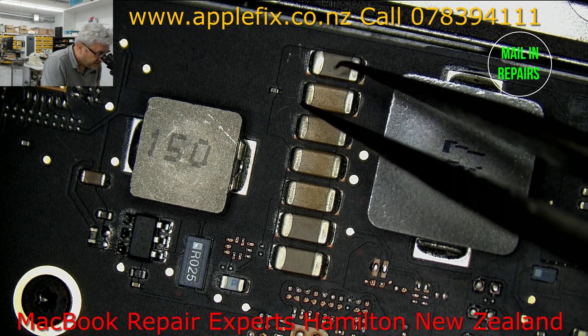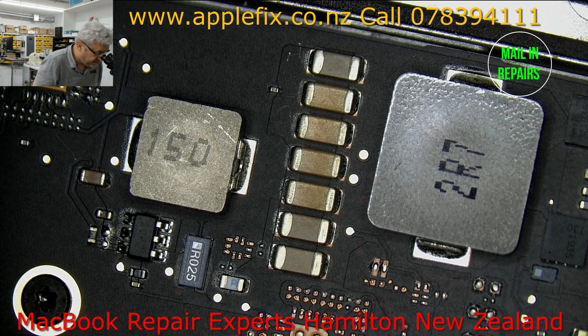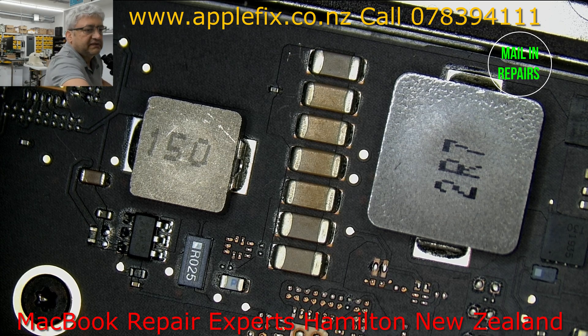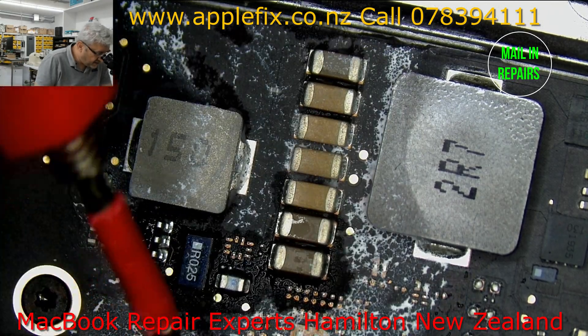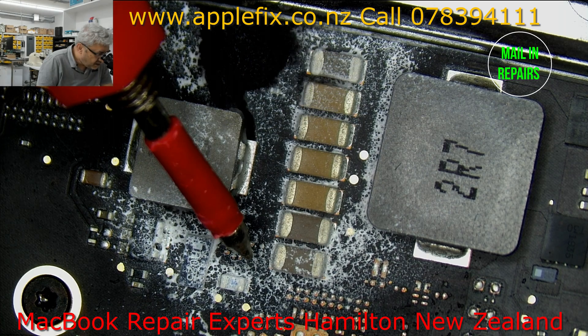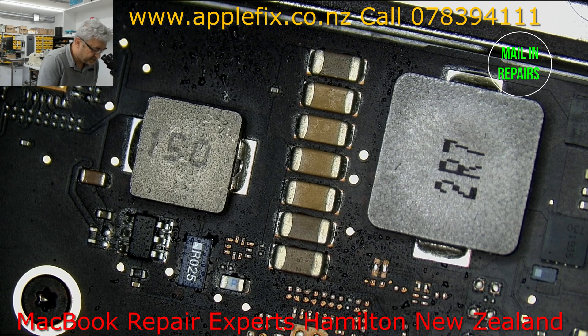It's one of these — I can't figure out which one. I don't want to remove them one by one. So what we can do here is use freeze spray to figure out which one it is. Isopropyl can help, but if the temperature is too low it's sometimes hard to figure out even with isopropyl. Using the freeze spray now — it's that one there, the second one. Let's remove it — most probably that's the one, and yes, that's it.